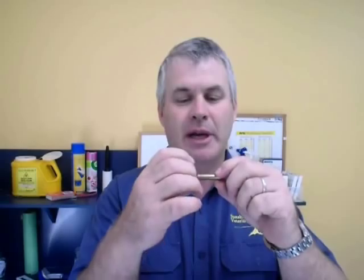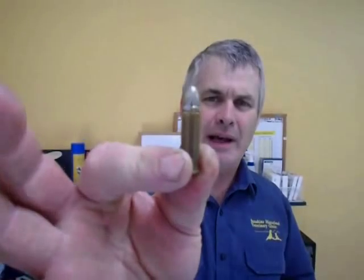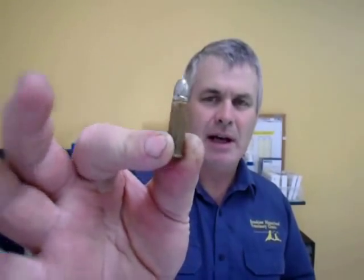If you have a quick look at it, it just looks like a small revolver cartridge. But if you look more closely, you'll see that unlike revolver cartridges which are straight walled, it has a slight taper, rimmed case, and if you look very closely, the last few millimetres of the case actually have a tiny little neck. It's more pronounced when you size a case in the full length resizing die. The reason for that slight taper is to ease extraction out of the Martini rifle, because as we've said before, it's got very weak extraction.